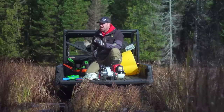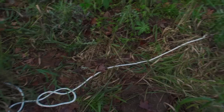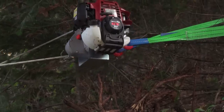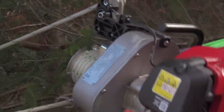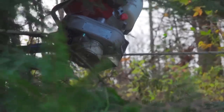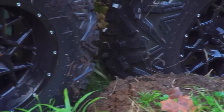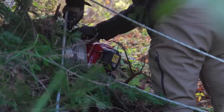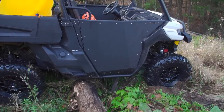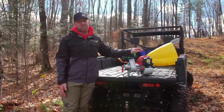I've been in many situations where I've gone in too far, been way too ambitious, and literally cannot get back out — that problem is no more. Most times it's out in the bush with a fallen tree or being in a swamp so deep it becomes a trap. The PCW 4000 uses a centrifugal clutch hooked to the Honda GX50 four-stroke engine, usable at any angle no matter how extreme your pull becomes. Once your tow object is strapped up, you wrap the rope around the drum a few times, then slip the rope through the anti-rollback mechanism — an arm that acts sort of like a throttle for the winch. When you pull on the rope the clutch recognizes you want power and starts to pull; when you release pressure, the arm holds the object from slipping back and holds the load in position while the engine idles back down.